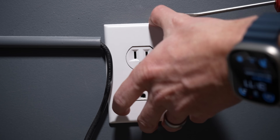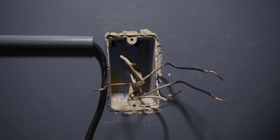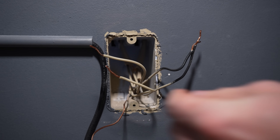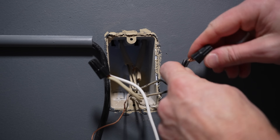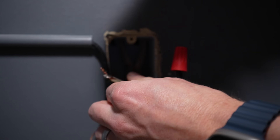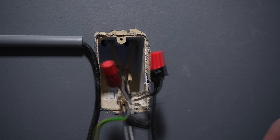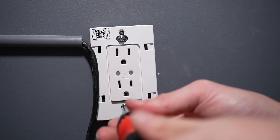First, be sure to cut the power to your outlet at the breaker. Remove the old outlet — you should have a line, neutral, and a ground wire. If you have multiple ones like I do here, you'll likely want to tie the same wires together and pigtail off them to the outlet. That will work just fine with the EVE Energy outlet, although the included wire nuts are not really big enough for more wires like this, so I did have to grab some bigger wire nuts for this installation. Top it off with some electrical tape if you wish — not necessary, but sometimes a good idea. And if you have any doubt at all regarding what you're doing here, please call a professional electrician. Electricity is not something to play with.